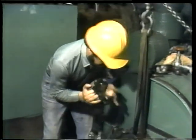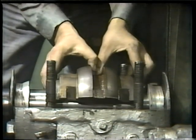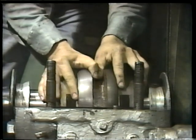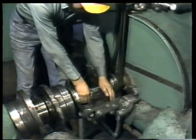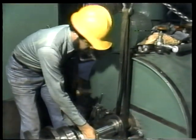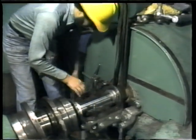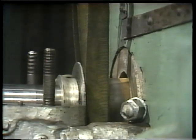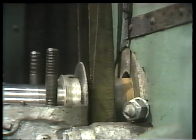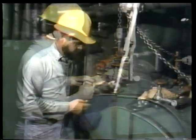The first parts to go on are the lower shell and its two bearing inserts. After making sure everything is in its correct inboard or outboard position, lower the shell onto the top of the shaft. Once it's in the right position, roll it down and around to the bottom of the shaft. To sink it down flush with the housing, it may be useful to give the shell a few taps with a rubber hammer. When the shell is in place, lower the shaft into position — the weight of the shaft now rests directly on the lower bearing.